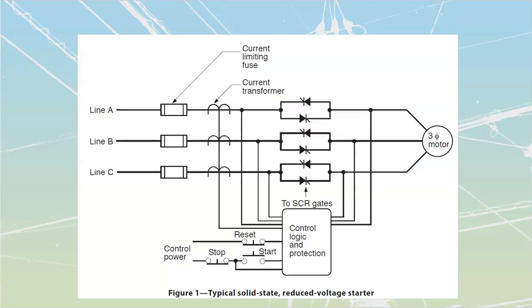What the soft start does is the same thing — it changes the amount of current on our input and allows us to ramp it in. But instead of just one or two stages like impedance starting or Y-Delta, this gives us a continuously variable one, which is really easy on equipment, drive chains, belts, gearboxes, and any sort of mode of equipment we have.